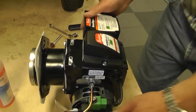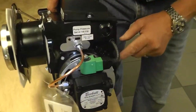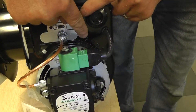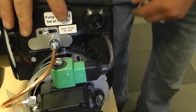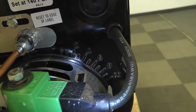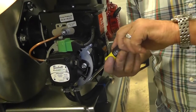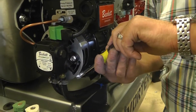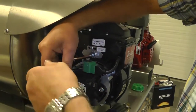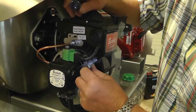Now, if you look right here at these arrows — on the 3400 PSI unit, this arrow is going to be set at 2, and that arrow down there will be set at 10. On the 4000, this will be set at 5 and this will be set at 10. If we want to change that — and that will be changed for different altitudes — if you want more or less air, you're going to loosen that screw and loosen that screw right here, and those things can be moved. That's letting more or less air in.